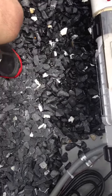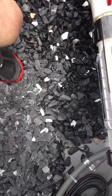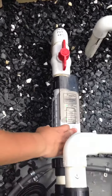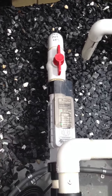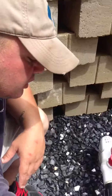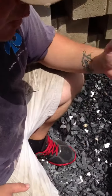Now if after 3 or 4 hours your sanitizer is still low, the IntelliChlor unit has something called a boost, which is like a shot. Think of it as adding granules to the pool by hand — very similar. You hit both buttons simultaneously, and what that does is allow 100% output for 24 hours. It's pressing down both buttons simultaneously. I'm not necessarily going to do that because I feel you don't need it right now.